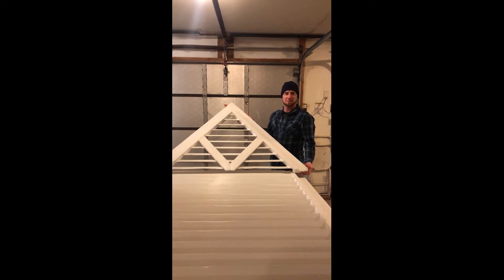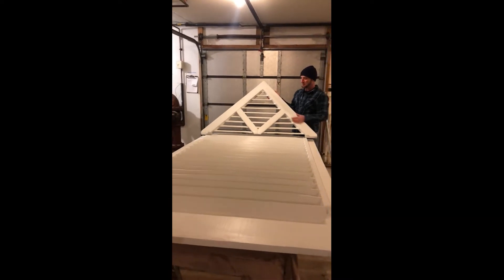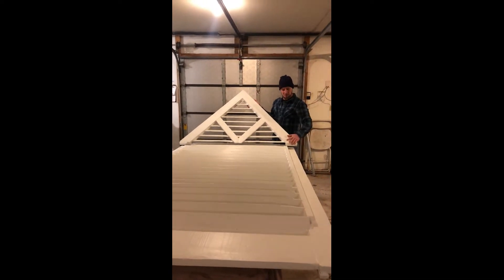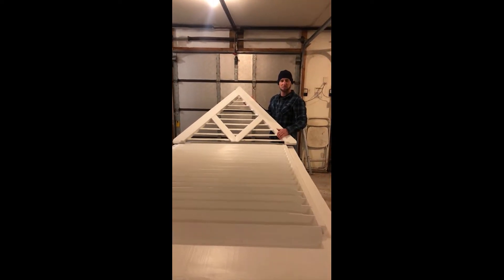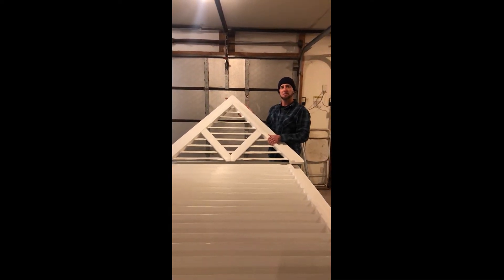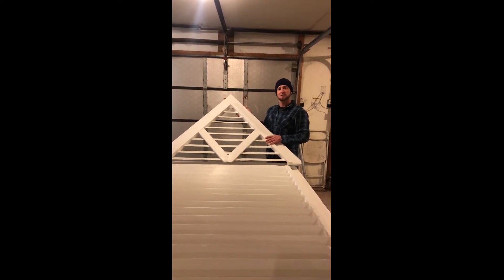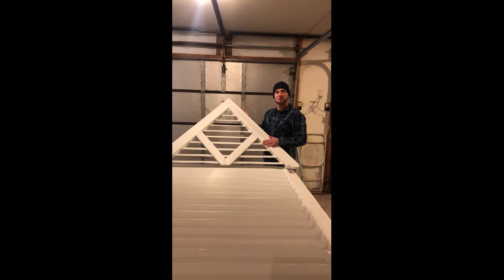This is one set that has been totally refurbished, preserved, and put back together. We went back to the white color, and we went the extra steps of making sure that we preserve it — we caulk it, we make sure it's sealed. Anything we can do to help prevent moisture from getting into the wood is what's going to help us preserve this for a very long time to come.